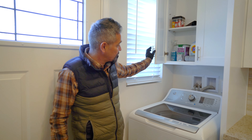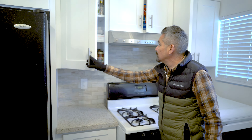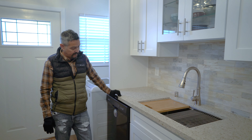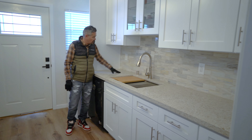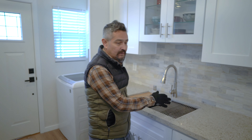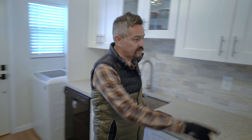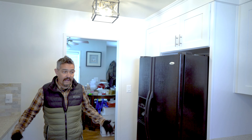The water overflow and all the detergent storage the client needs has its own circuit — you can see we put it there. There's a circuit down there as well. Self-closing drawers, countertop is square — not bull nose — with a matching backsplash. We have a GFI circuit here and a GFI circuit here because we have water. Any water appliances that burn out or touch water will instantly blow — it has its own circuit and will fuse and kick off. This one is also daisy-chained to it, but it's not GFI.